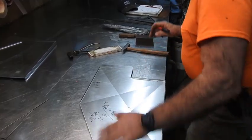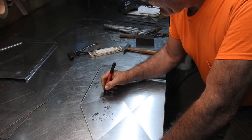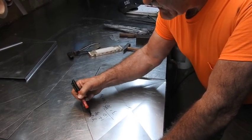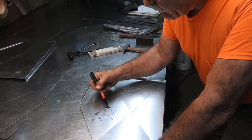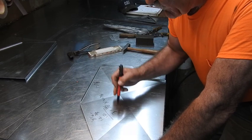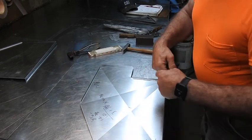If I remember right, that width was 18 and 3 quarters plus 2, so that would be 20 and 3 quarters. So we can double check that. 7 eighths plus 4 eighths is 11 eighths, so that's 3 eighths left over. Add 1, 12, 22, and 9 is 31 — so 31 and 3 eighths by the width, 20 and 3 quarters.